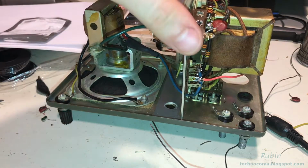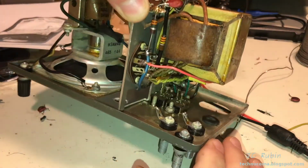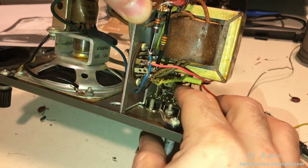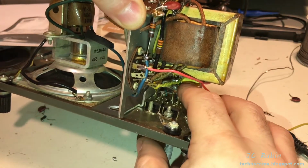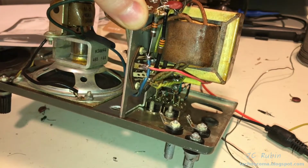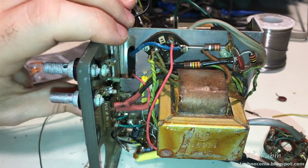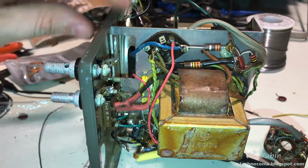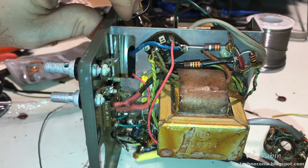the AC. I've been thinking maybe it would be prudent, given the available space to work here, I might put the on-off switch in the lower position, only because I have a better view and a little more clearance for the 120 volts. I'm also going to put some shrink wrap around those connections as well for good measure. So now I've got the second half of the AC installed to the switch down here. This is the old noise switch. This completes the power relocation and leaves this hole available now for the tone knob, which will be installed next.